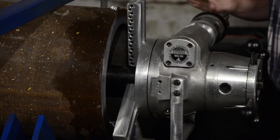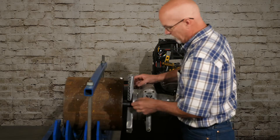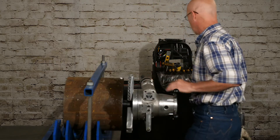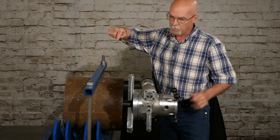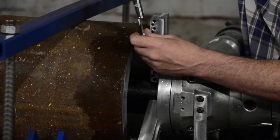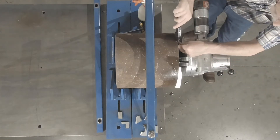Now that we're done facing and the end of the pipe is square, if you need to counter bore, you'll use your counter bore bit, counter bore that out, hit your target, then you just have to measure the wall to do your setback formula. If you're not counter boring it — and I'm not going to counter bore this pipe — you need to measure in several locations the wall thickness and find the thinnest spot to do your math off of.